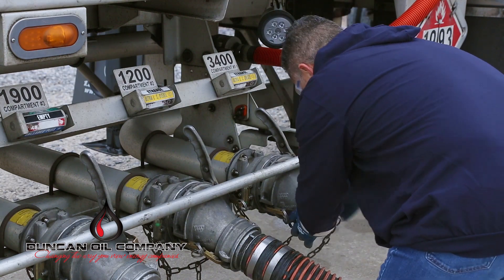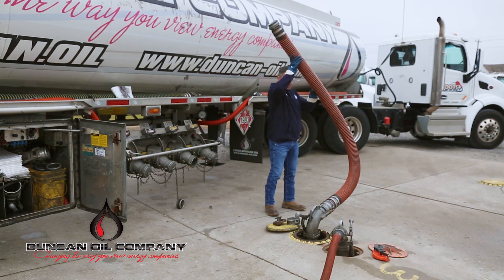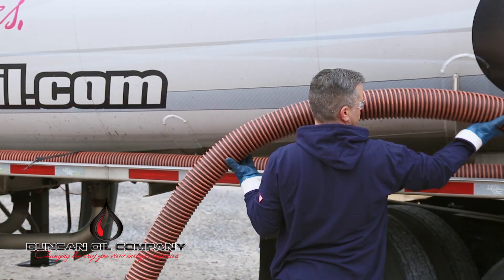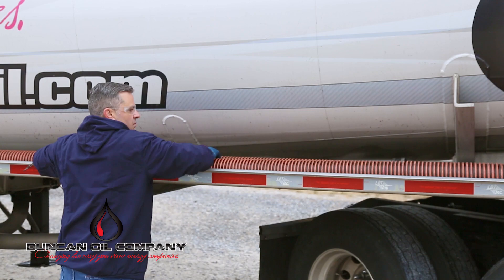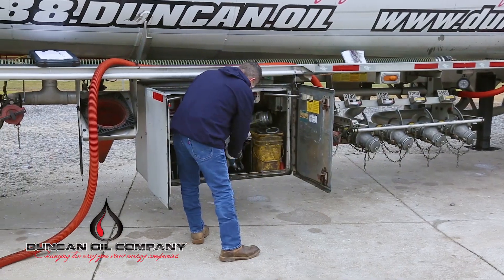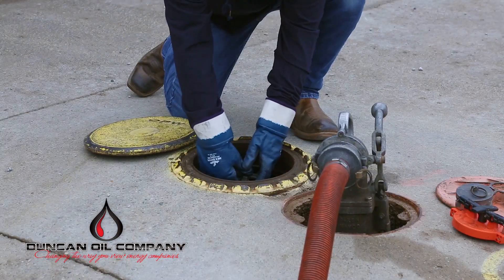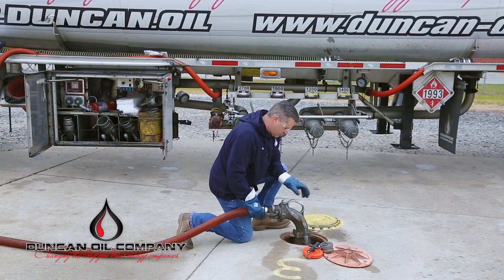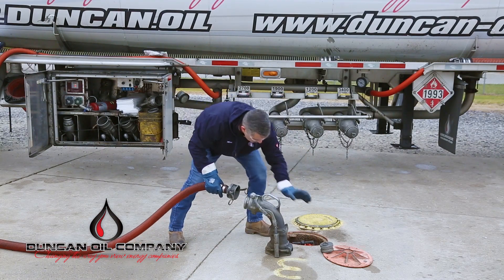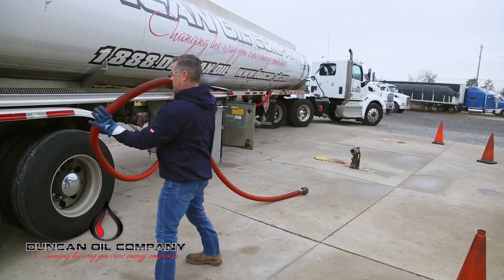Once your delivery is complete and you're ready to disassemble your unloading hoses, disconnect your delivery hose from the trailer. Manually elevate the delivery hose and walk down any residual product left in the delivery hose toward the underground storage tank until the hose is empty. Disconnect the delivery hose from the drop elbow and return to the appropriate secure position on the trailer. Remove the drop elbow from the fill adapter and secure in the appropriate position on the trailer. Manually gauge the tank with a measuring stick and record on the delivery receipt. Remove your vapor coupler and hose and return to the appropriate secure position on the trailer. Return and secure the vapor cap on the underground storage tank vapor adapter.